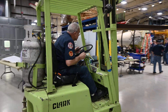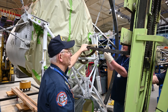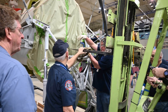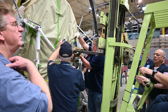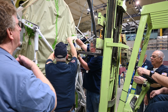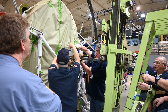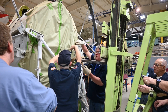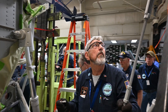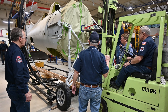We'll roll the rotisserie out of the way, bring a small forklift in, pick it up, and move it outside. So we brought in the second forklift to attach to the front of the aircraft, with the idea being that the forklifts would take the weight of the aircraft. We would remove the support and turnbuckles, and then we would lower the aircraft on its own two wheels for the first time since World War II. So pretty simple plan. Once they got the forklift attached, they then removed the turnbuckles, and it was time to actually put the aircraft on its own two wheels.